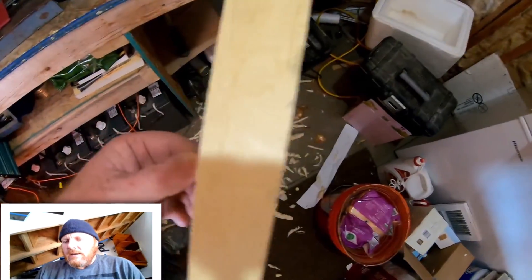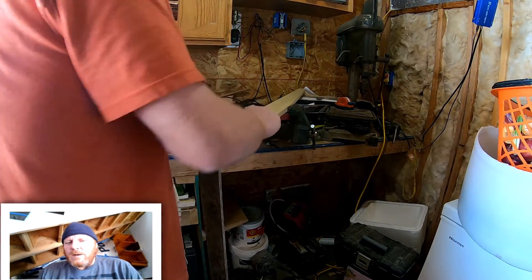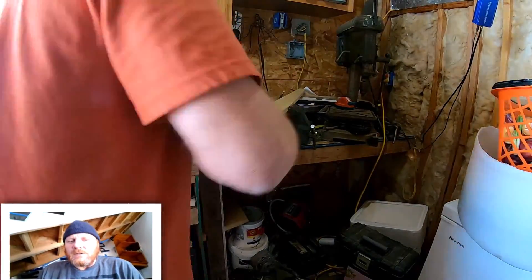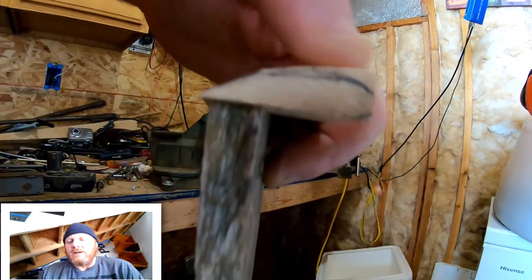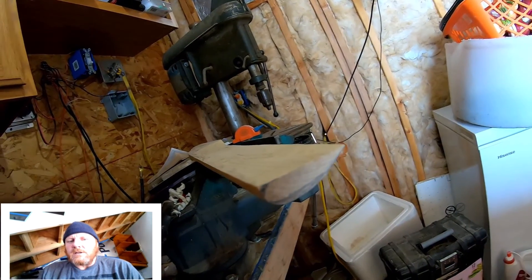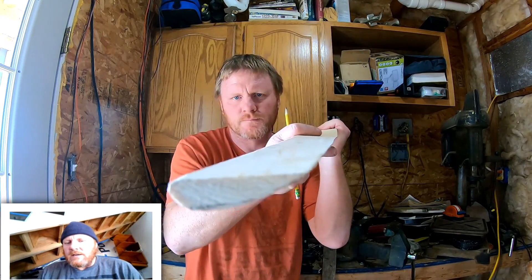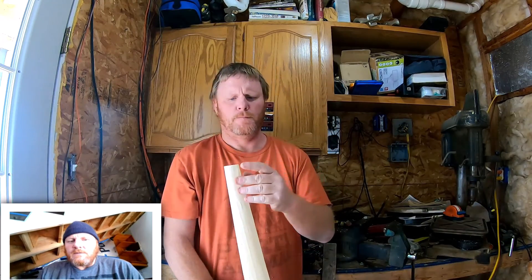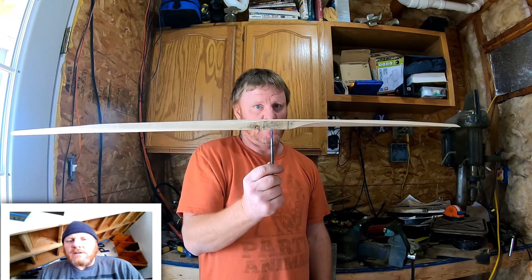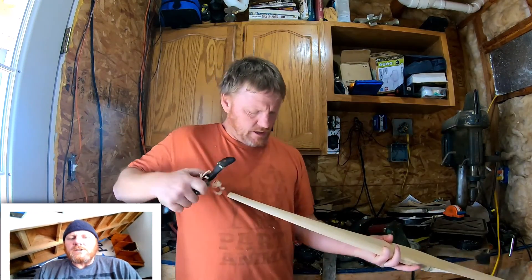The original website I found this design on was something like Wind Gen Zen — it's an old website showing how to carve these blades. I looked at them and thought, 'I can carve one of these, piece of cake,' and they were. I'd suggest this design for small to mid-sized wind generators — maybe up to one or two thousand watts. These ones here will give you at most around 500 watts. You can see the airfoil shape, which I think lends to the high speed and efficiency of this blade design. Here I'm balancing it — it's so easy, and if one side is a little heavier you just carve a little more off. Simple.